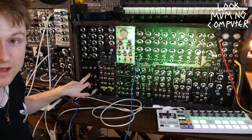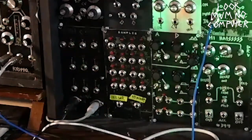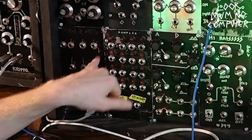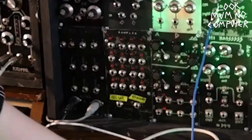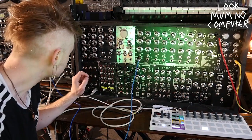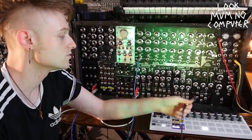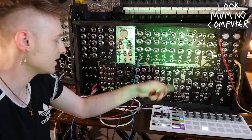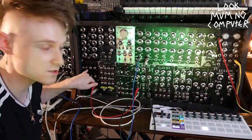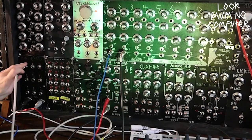How do I trigger these? Well, down here there's a MIDI to trigger module with a MIDI in and MIDI through, which then goes over to the other box — the MIDI to CV. This module has nine MIDI trigger outputs so you can trigger nine different drums with it. It's an Arduino project and I'll probably share it very soon. I can also use different drums out of the Beatstep Pro, which can control 16 drum pads. I've added an extra output to the kick to plug over to the side chain.